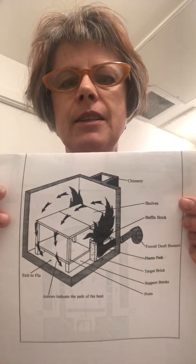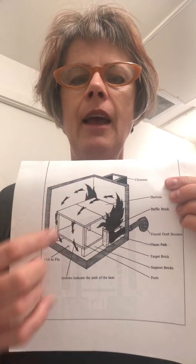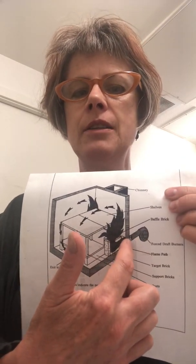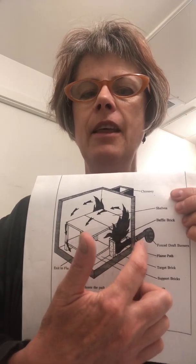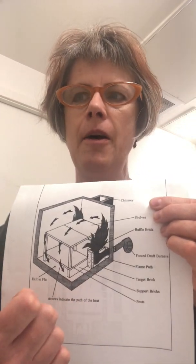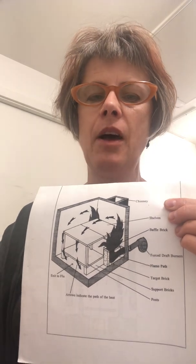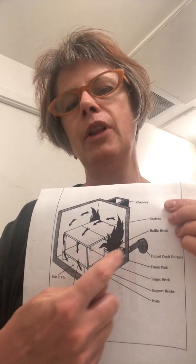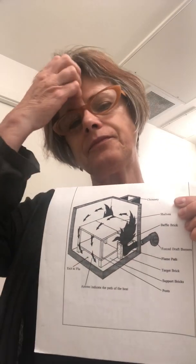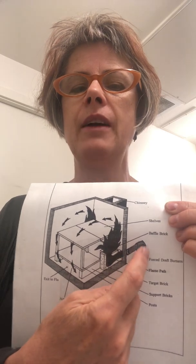They look like this in design. Here's the exterior box of the kiln, this is where the front door would be, and you're looking through the kiln to where the burner is coming in — where you see these black flames — and also this circular thing over here which is what we call the squirrel cage. All our kilns — the soda, the Claytarian, and the car kiln — are all forced air, so there's a squirrel cage with a little motor that blows air in at the side of the burner.